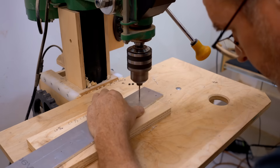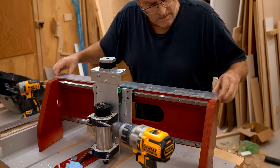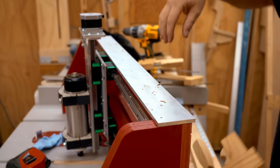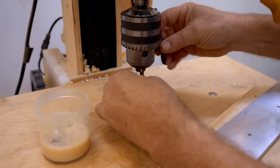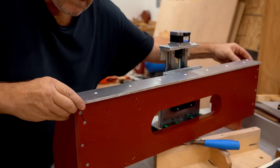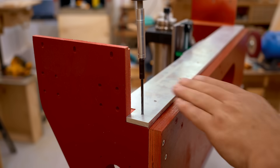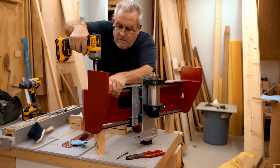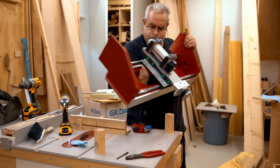To fasten the aluminum plates onto the gantry I'm using inch and a half wood screws. I mark out and drill the holes slightly undersized so I can use the plate itself as the template for drilling those holes into the gantry. Then I bring it back to the drill press, drill out the holes to the right size, and countersink them — once again using baking grease to aid in the cutting. When I got all the screws driven in I brought it back over to the machine and got it put back on. This thing is heavy.